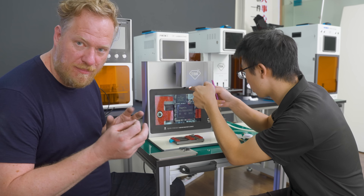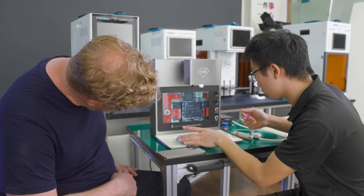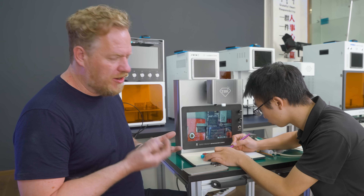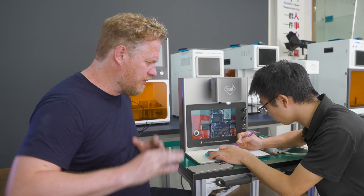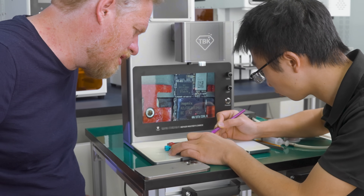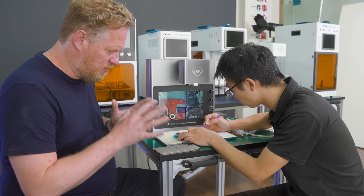He's lining up the laser and adjusting the focus knob underneath. On a few of the chips on the iPhone there's an underfill epoxy that holds the chip on the board in addition to the solder, and I think he's just scraping around the outside of the chip removing the underfill. So he's just using it broadly right now.